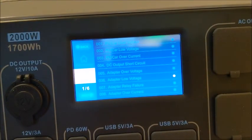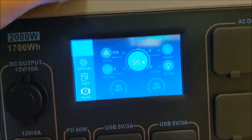So like I said with my thought process here of running parallel battery packs, you're only going to be able to run them from 40 volts down to 35 volts, which is the limit of the Bluetti. Where if we hook them up in the serial configuration, hopefully we can run it down, and hopefully we can prove that. So let's go ahead and back out of here.